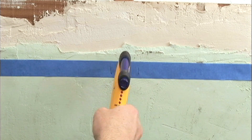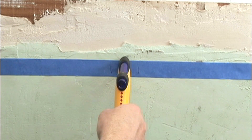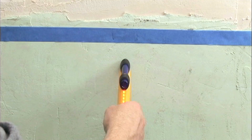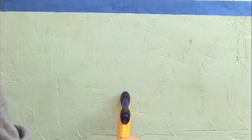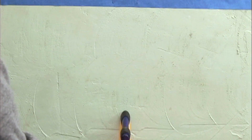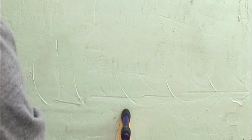Then to confirm that you found a stud, run the M40 vertically. You may need to decrease sensitivity so the unit goes on and off as it passes over each nail. This way you know it's definitely finding a stud, not plumbing.